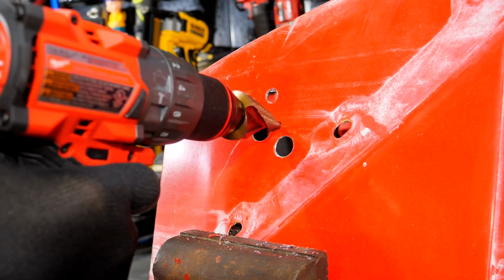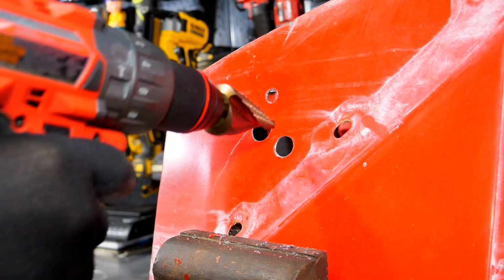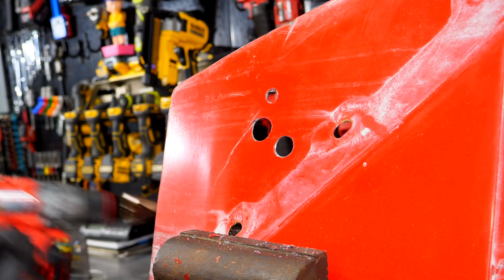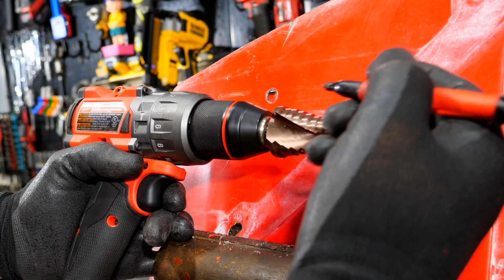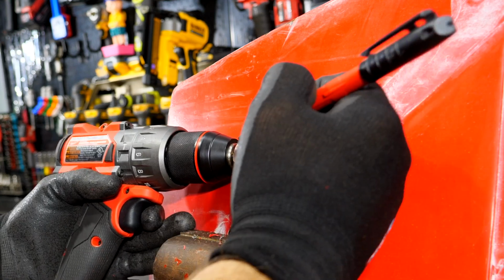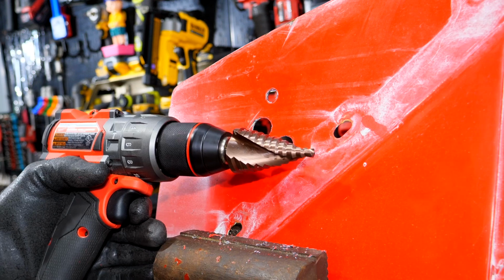So I want to go in, and I'm not going to be able to read that as I'm drilling, right? So I need to make a 1-inch hole, and I need to be able to easily see that. Well, here's how we can do that. And this is not rocket science. This is not the first time it's been thought of, but just take a Sharpie marker and mark the flute to where you're drilling. Now, some will say you can either do the one that you're going to drill on or the one that goes beyond it, so that you can actually see it.